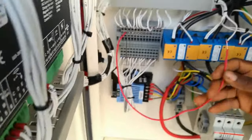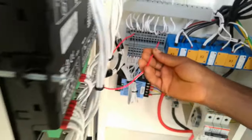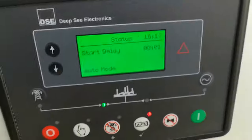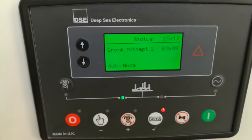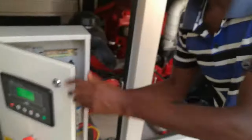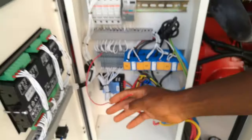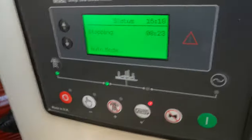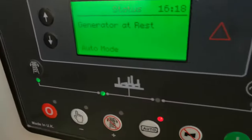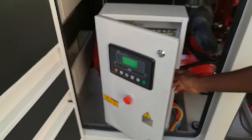This loop is representing the command from the ATS. Let's put the wire down there — okay, good. The moment he attached the wire, the gen started, and when he removed it, the gen stopped. That's all we needed to see to be sure the ATS and the gen work together.